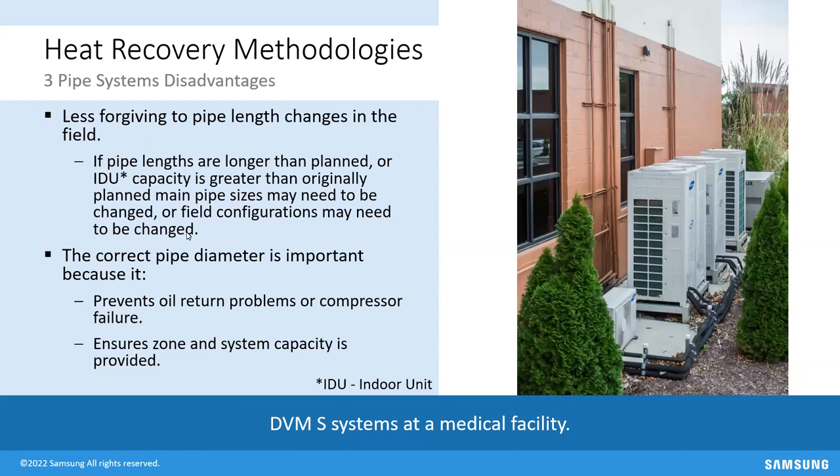Question: is this using R-410A? Yes, all currently using R-410A. There's ongoing discussion about moving to R-32 — a component of R-410A — but R-32 is an A2L refrigerant with higher flammability, meaning under the right conditions there's a potential for an ignition source. Samsung is still investigating which refrigerant to move to, with the goal of minimizing changes while achieving lower flammability. For now, everything is still R-410A.